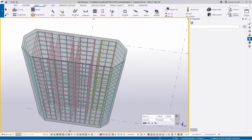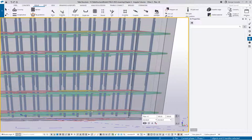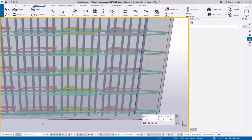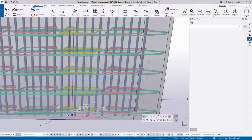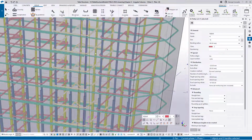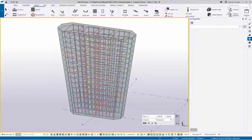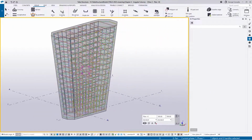And that's perfect. Now, the only thing we need to do is just make sure that we don't have clashes, because Tekla's got a tendency of flipping the direction. So if I click on here, that direction arrow, let's see where it is. It's pointing up, so it's kept it this time. Those internal legs are now finalized as well as the outside, and now we can move back to the verticals and finish them off.